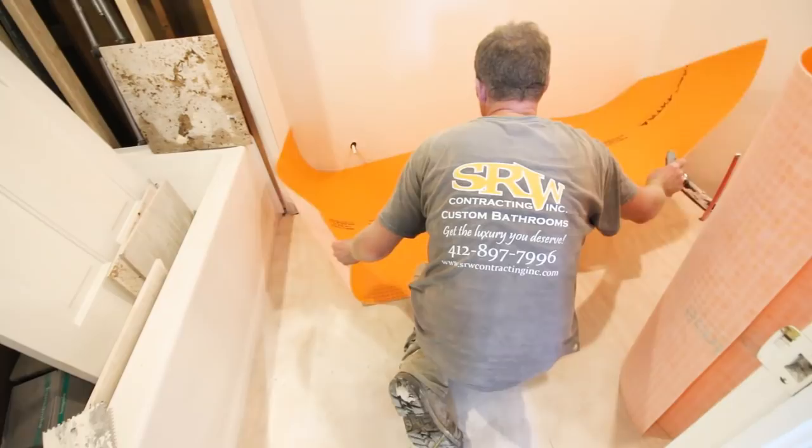How do you tile a bathroom floor? In today's video, we're going to share how to tile a bathroom floor using 18 by 18 inch travertine tile and get it looking awesome. One of the issues with travertine is sometimes the back of the tile can have divots or be uneven. We're going to share several tips on how to back-butter that tile and use T-Lock to get the tile floor nice and even with uniform grout joints.